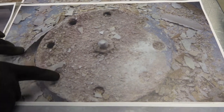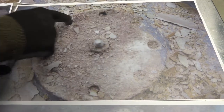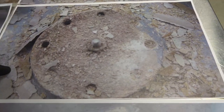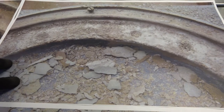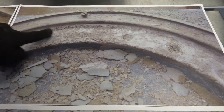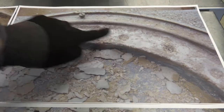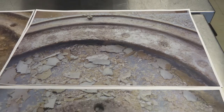In this picture there is excessive scale and loose residue on the racetrack area, and the center island has several restricted vertical steam ports. In this last picture, loose scale debris and the outer steam ports are completely obstructed all the way around. All this will impact steaming performance.